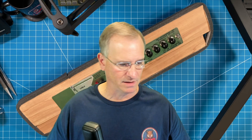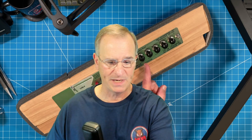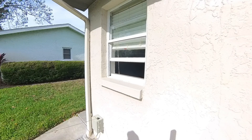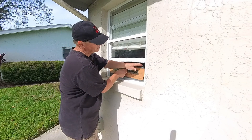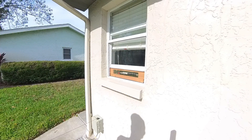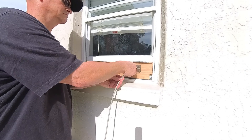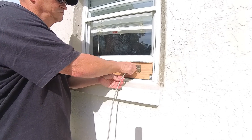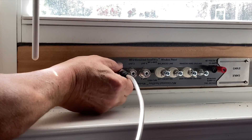The final thing to talk about is your weatherproofing. Anything exposed to the outside that you don't make a connection with — make sure it's weatherproofed properly. If you do put a piece of coax on here, you need to wrap that with weatherproofing tape. If this is your application, you'll be doing some additional activities: possibly caulking, definitely painting, maybe some additional weather stripping. This took me about an hour to get to this point and it fits perfectly. The only thing left is to get coax connected on the outside and then on the inside. Don't forget to do that weatherproofing on the outside and make sure all connectors are weatherproofed to your satisfaction. Time to hook up and play radio.